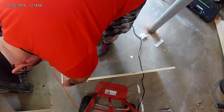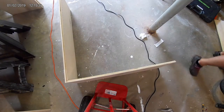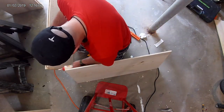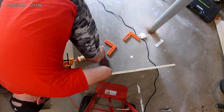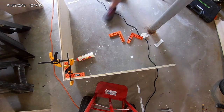Alright, and here we go with building the shelves to the right or left of the desk. These are pretty robust shelves. They have a 17 inch depth minus the route, and then of course that half inch there where I'm going to put a board. Here we have the positioning squares that I'm just using to make sure I can get the boards in a good position.